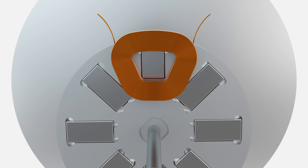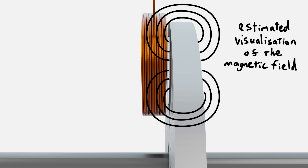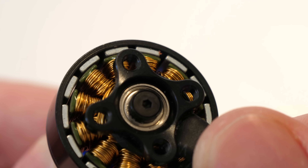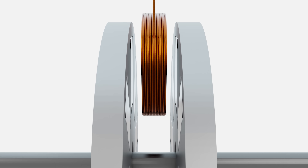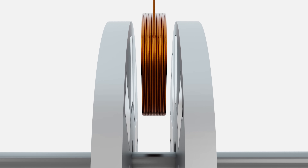There's just one issue: the distance between the magnets and the coil affects the efficiency of the alternator, as the magnetic field is weaker with increased distance. This isn't a huge issue in conventional alternators since they can run magnets very close to the coils due to tight-tolerance bearings. However, this magnetically levitated axle isn't precise and could risk the magnets colliding with the coils. To overcome this efficiency loss from the large safety gap, we can add a second rotor of magnets on the other side of the coil, which greatly increases the strength of the magnetic field in the coils and allows plenty of space for the shaft to wobble.